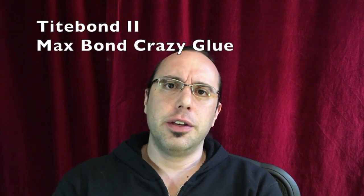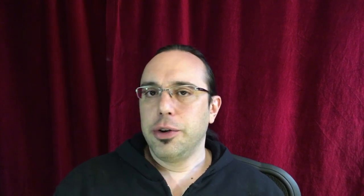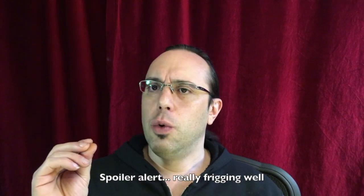Since I was doing it, I just ran a camera and I'll put it up here in case it's useful to anybody — I imagine it would fall mostly into the purview of people building guitars, guitar-type instruments, or maybe furniture. The glues I tested were Titebond II, standard or heavy-duty cyanoacrylate (just the heavy-duty crazy glue), JB Weld (the slow-set, not the fast stuff), and Gorilla Glue — just the standard polyurethane foaming Gorilla Glue. I already knew how Titebond, Gorilla Glue, and cyanoacrylate dealt wood-to-wood, but I didn't know how JB Weld would, what clamping force you'd need while it's setting, or how thick the glue joint should be.